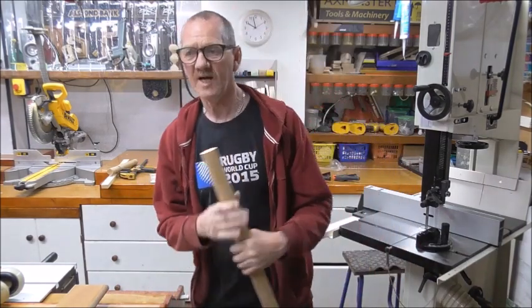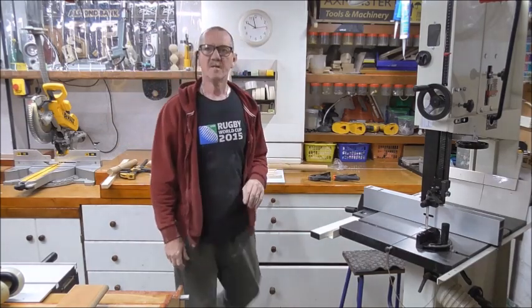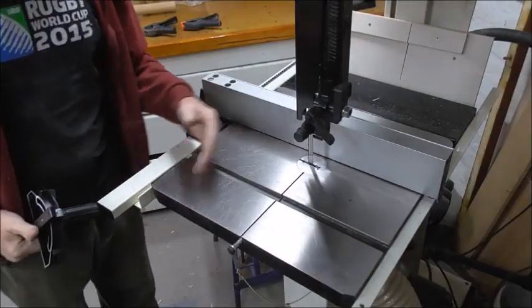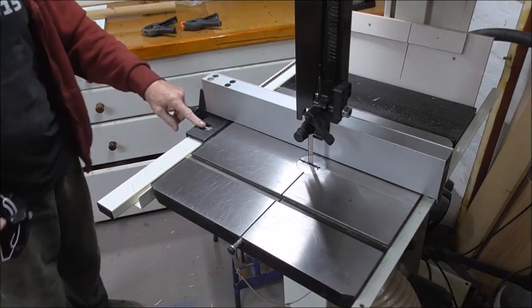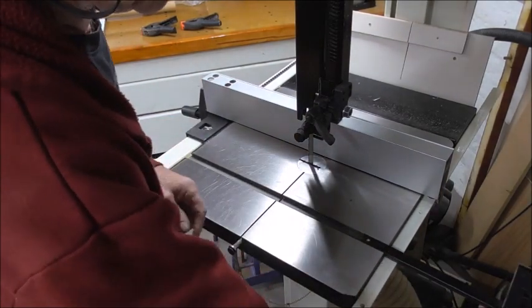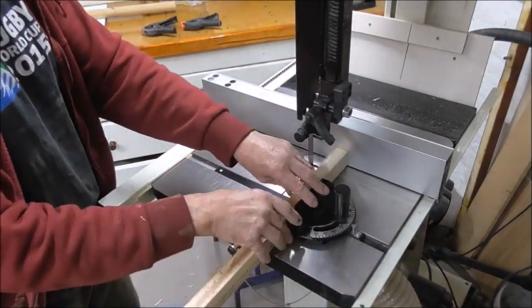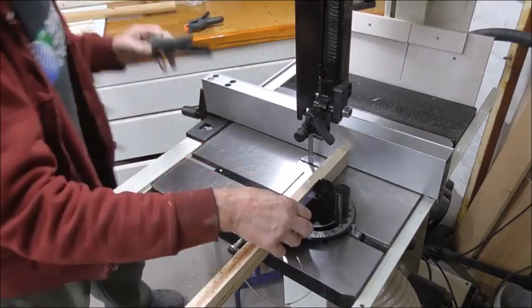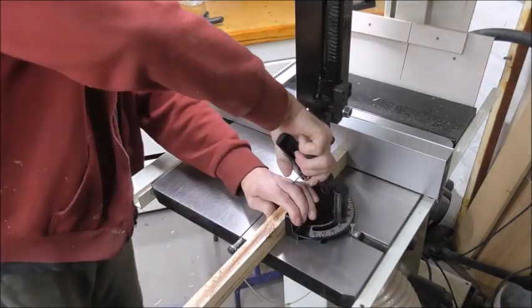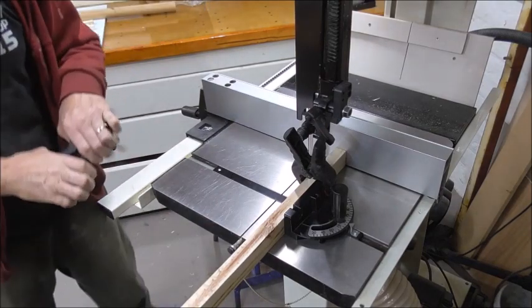All kinds of ways — let me show you my way, using a bandsaw. Set up: put your rip fence on, calibrate where you want it to be, a couple of trial and errors to get it right, but you'll get there. Put in your mitre fence. I'm going to put a block in — that will stop me just there. It's a one-time thing, you don't need no permanent jigs or anything making for it.